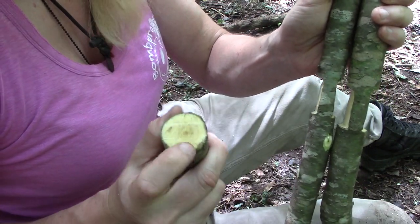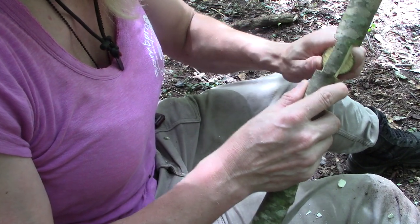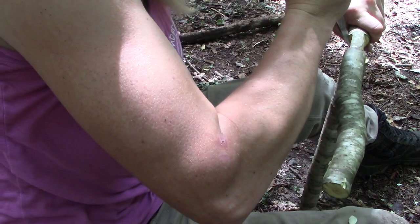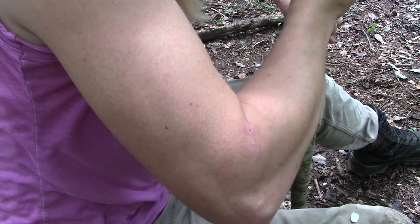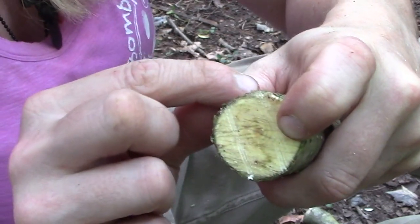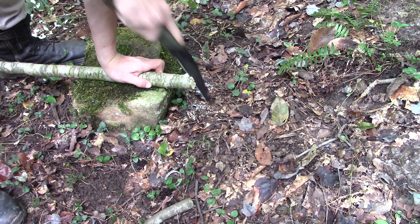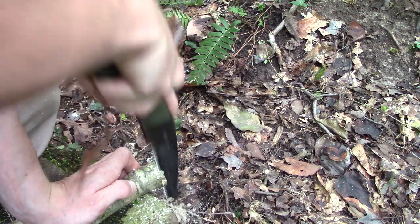Now we're going to go ahead and carve on our cross member. So we're just going to take a real quick measurement and go, okay, how wide do I need that? We'll take our knife and score where we need to cut. And I'll know that I need to take out this middle piece at least down to about an inch into here. So now we have sawn through our cross member. We're going to knock that piece out right here in the center.